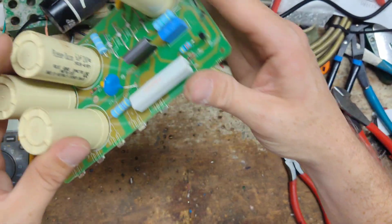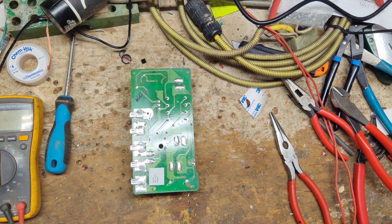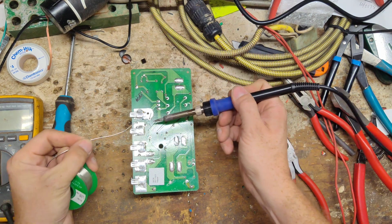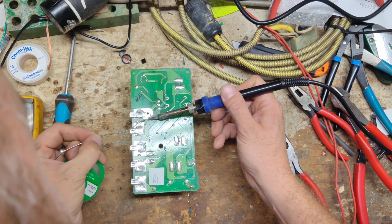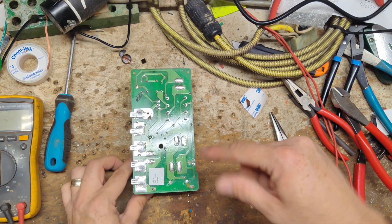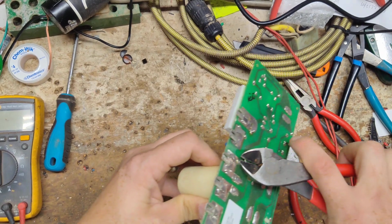But hopefully that guy didn't have the same problem. Usually this issue where these things burn up is from lightning, and you replace these 2 parts, and usually the unit goes right back to working. At least the board does. It might have other problems, and if it still won't come on, then we've got a deeper dive into the board to do.